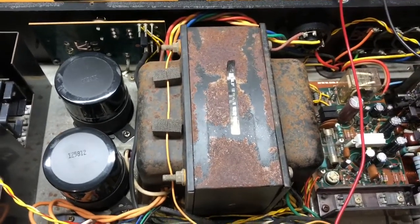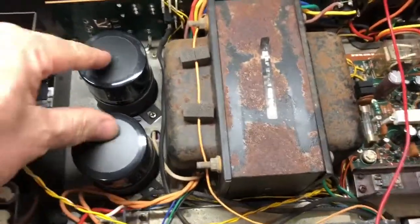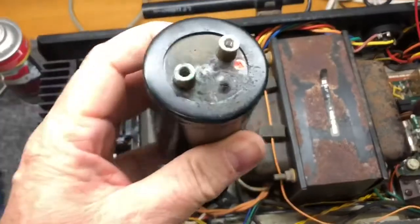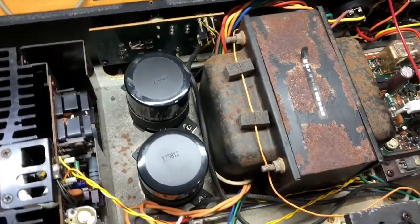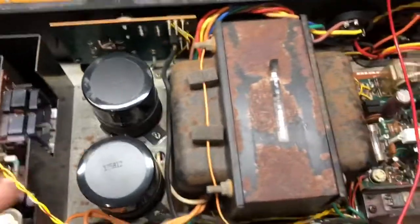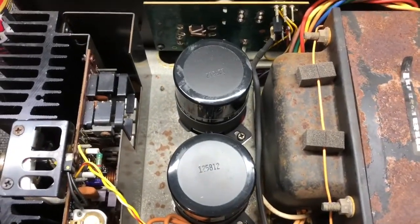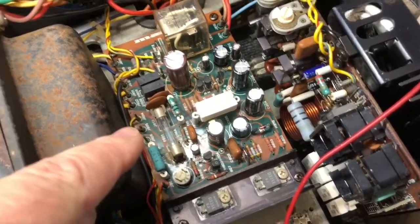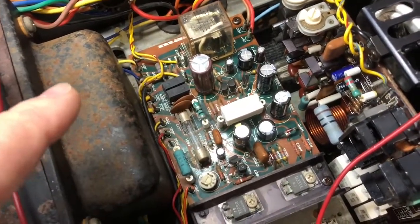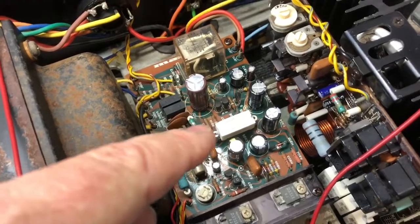Now, as I mentioned, this old girl had seen better days and I've had to do quite extensive work on this. One of the filter caps had absolutely spewed its guts out. On the underside there was a big spray of electrolyte, which had caused quite extensive corrosion. So I've replaced both of the main filter caps with lovely Illinois capacitors, slightly up-spec on the original parts. I needed to do a lot of work on this regulator and protection board — it was really bad. There were some corrosive glue problems — the polychloroprene glue that causes so many problems in older gear.